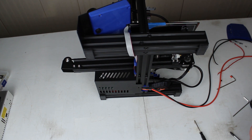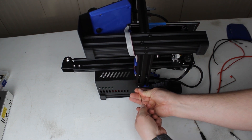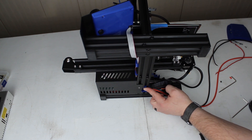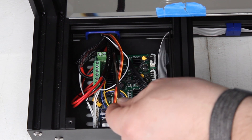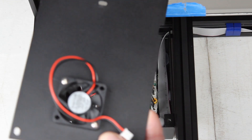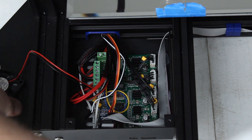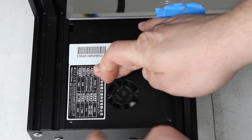Grab your allen wrench and tighten the smaller bolt back in. Notice the wires run through and under the cutout here — I actually printed a cover for this from Thingiverse and I'll put the link below; it protects the wires from the sharp frame edges. Looking through the top, you can see the new wires — red on the inside, black on the outside. Go ahead and put the top plate on. If you removed your fan, reconnect it now — it can only go in one way. Push it in, make sure it's tight, then seat the top plate and put the three screws back in.